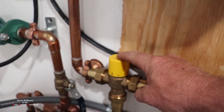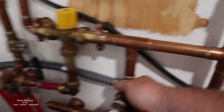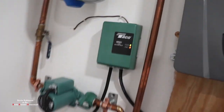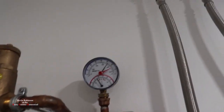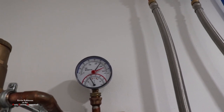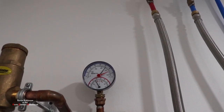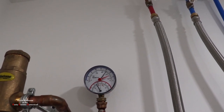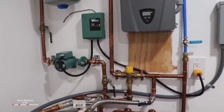I shut this thing down so it's not actually sending water through that valve yet. I just wanted to circulate through the system to see if these warm up, and they're starting to warm up — they're not as cold as they were. As you can see, as it circulates it's losing more pressure because the heat's going down. We were up to about 65 pounds of pressure and the temperature is still about 100 degrees, maybe a little more. So we're going to let it run for a little bit and let it cool that water back off.